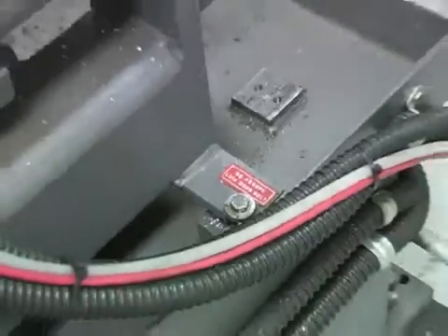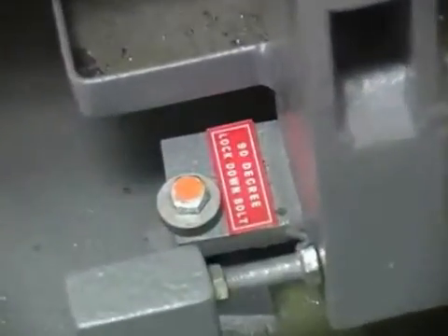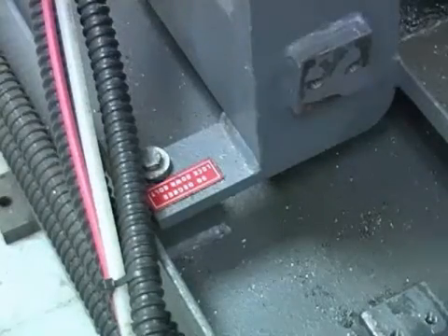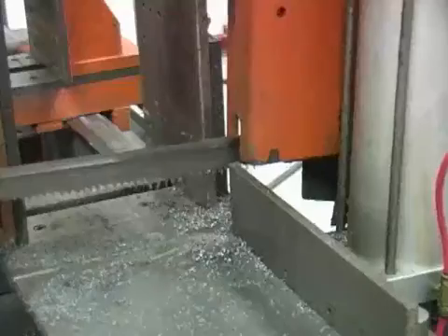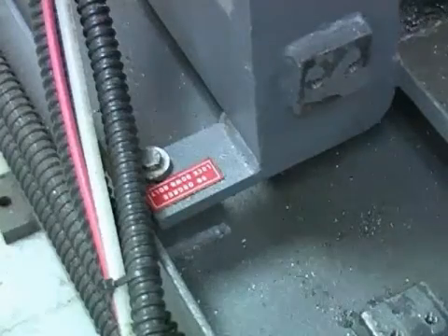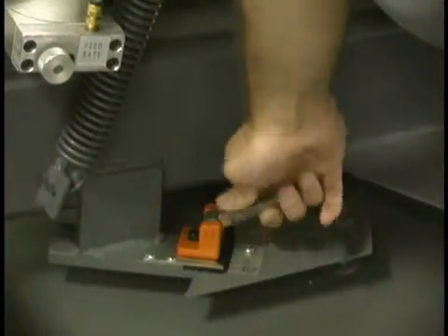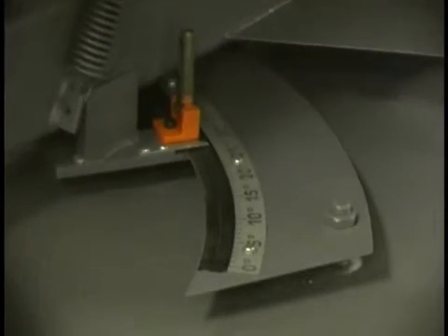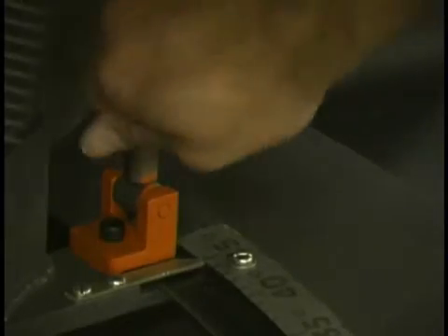There are two lock-down bolts at the pivot end of the saw. These bolts can be tightened when 90-degree cuts are going to be made, providing more stability to the arm. They are loosened to allow the arm to swing to the desired angle when making a miter cut. To swing the arm over for a miter cut, first be sure the arm is raised enough for the blade to clear the cut slot. If the 90-degree lock-down bolts are tightened, loosen them before attempting to rotate the arm. Loosen the cam lock handle and rotate the arm until the pointer aligns with the desired angle on the protractor scale, then lock the cam lock lever down before cutting.